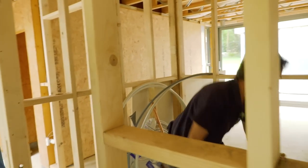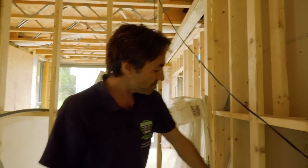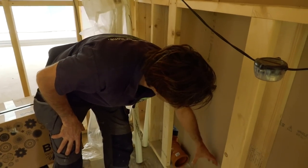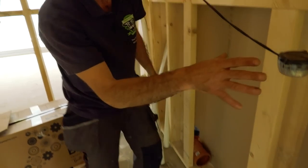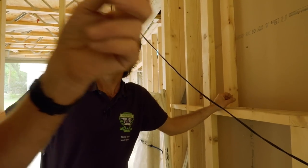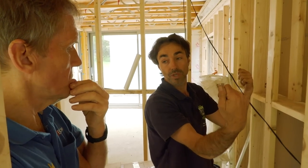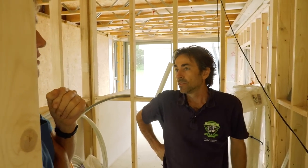Into this little bathroom - this is where your pre-walls are going to go. This wall has been made double-thickness - it's two studs wide - and where the soil is going to come up this is exactly the size of one of your frames: 500 millimetres, it'll stand straight in there and bolt straight back. You've got that lovely bent pan connector that comes as standard, which goes straight into my soil pipe. I've got the hand basin here and the waste can pass through and link in. It's going to be an in-wall unit, so we'll need to work out whether I can get a mirror cabinet that covers the whole area nicely.